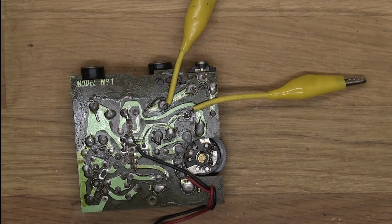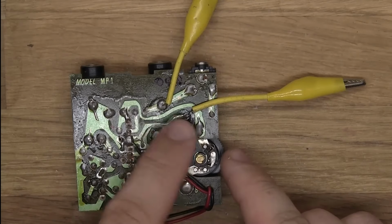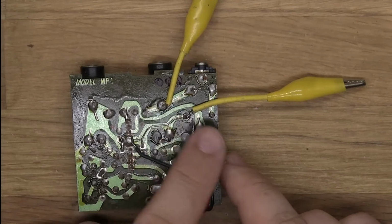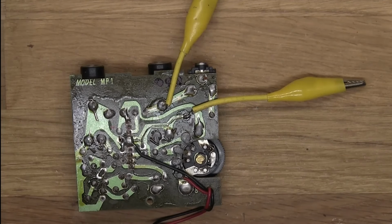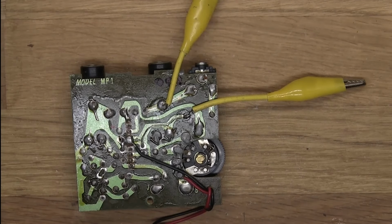And I just want to say that I don't think I'm going to do it in this video, because the thing will become too long. But you should also write things down and go back and forth. And maybe you should have a capacitor here and not a resistor. And then maybe you should have your diode clipping here or something. So you should go back and forth and experiment and really find out what you like. But I'm gonna sort of just wing it and see what happens.